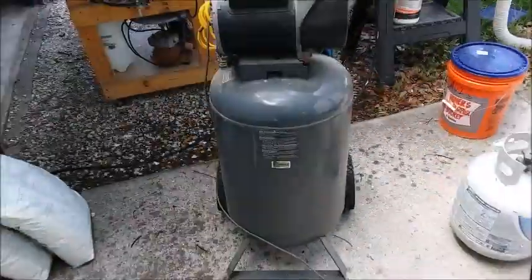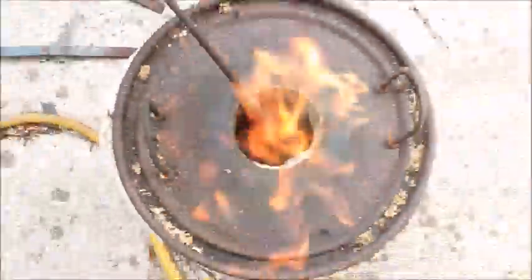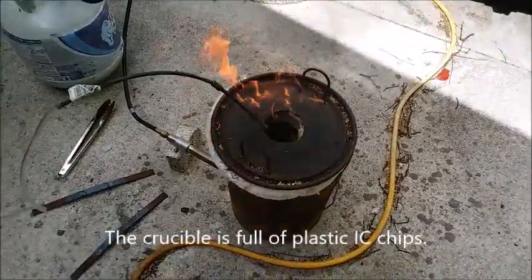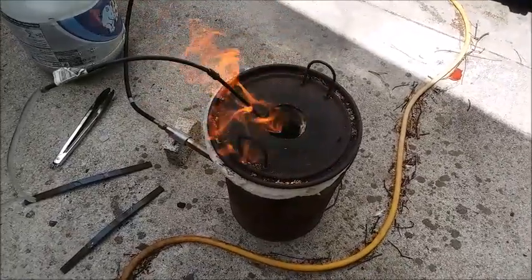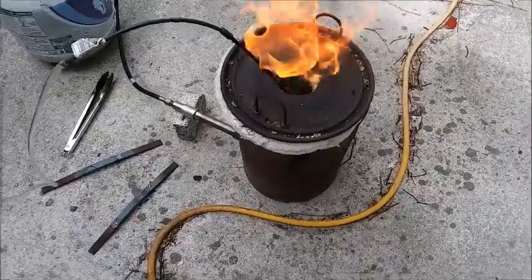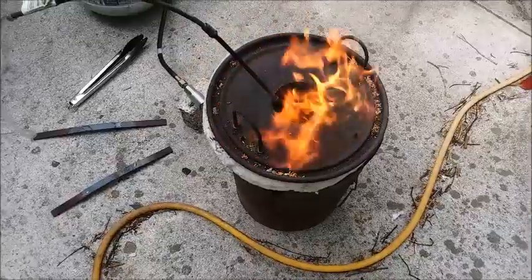What I've done here is I've got my air compressor over here with a little regulator, and I'm running a little trickle of air through a steel brake line into the bottom of the crucible in the foundry. The air is actually helping oxidize all of that carbon that forms during the pyrolyzing process, and I get a much better ashing of the chips — they come out nice and white all the way through. The carbon is all burned off, and the fluffy ash is so easy to separate from the base metal and the gold. Plus, pumping air in there, I get a lot less smoke when I'm pyrolyzing the chips.